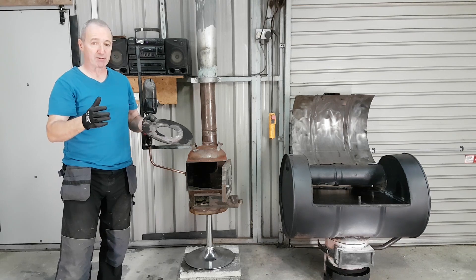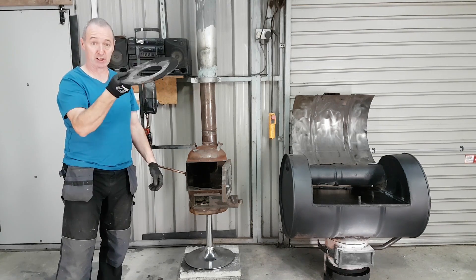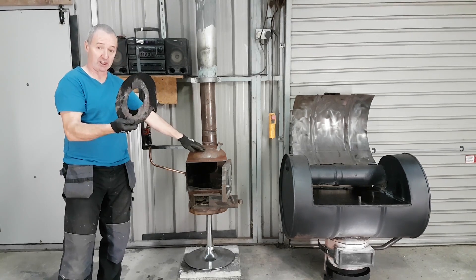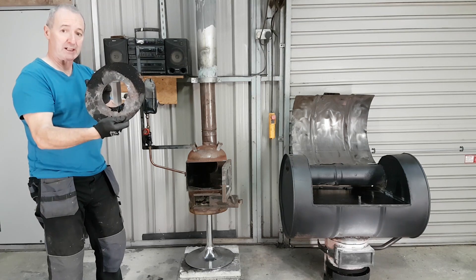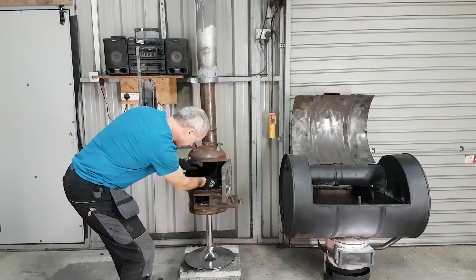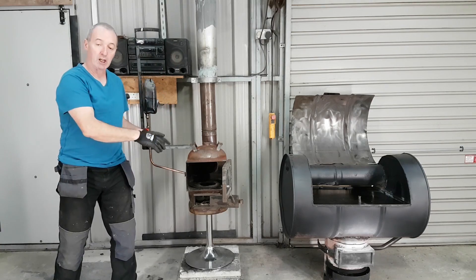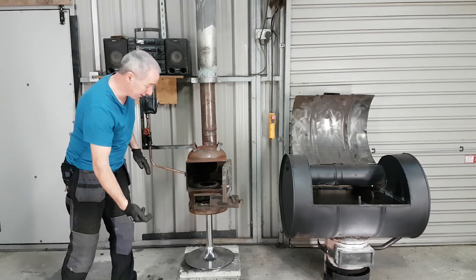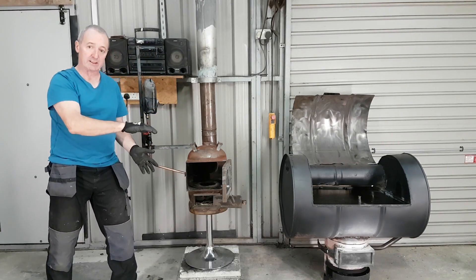It works really well on this sort of thing — it's very small, cheap to make, no dearer to make than that disc. This is out of another one I made. It fits this size of propane bottle no problem. So I'm just going to install it now and get this thing lit. It's a bit tricky getting in but it's in and it's flat now. All the air for combustion goes through the bottom chamber and comes through that little hole in the disc that I showed you.